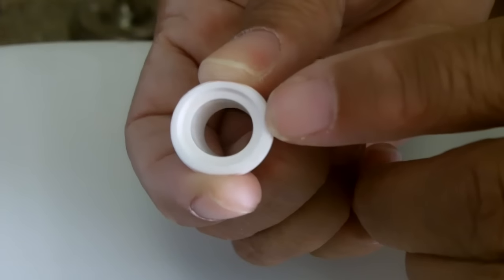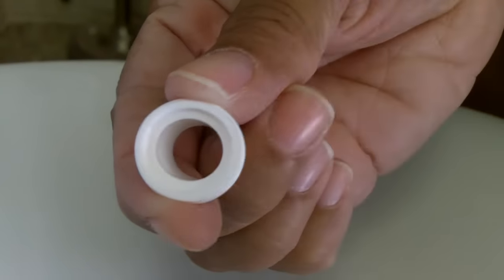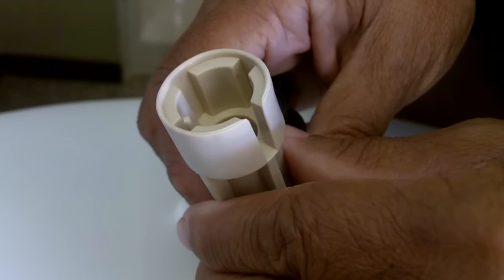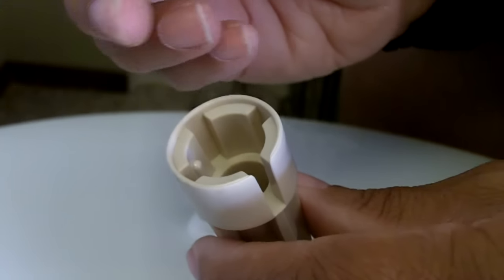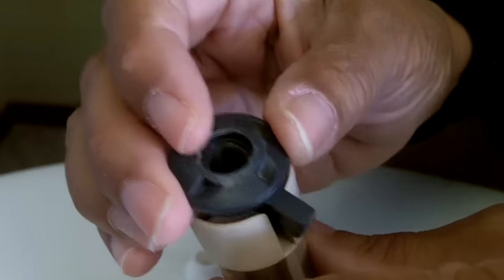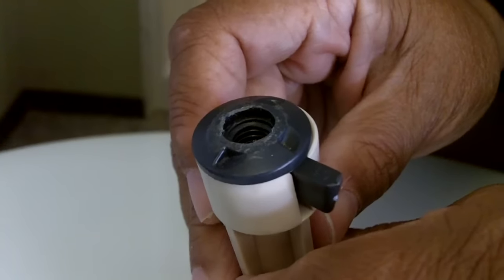To bring it in close, you can really see what the washer looks like. And here's the thing — see I'm squeezing it? It's flexible. Well this is the tool that comes with the package. What it does is, there's a little slot right there. The way it works is, you take the toilet bolt nut and replace it just like that. It's designed to hold the nut in place while you tighten down the bolt.